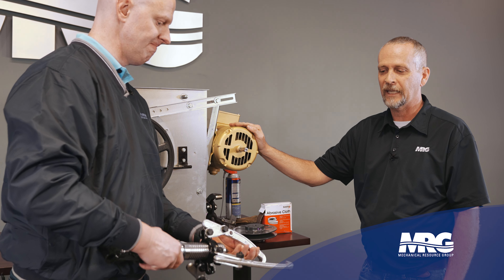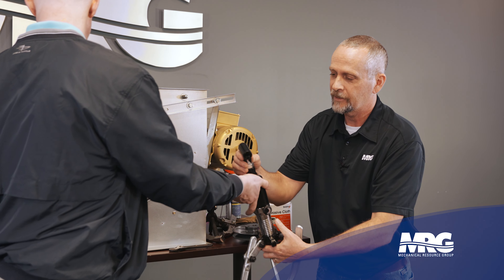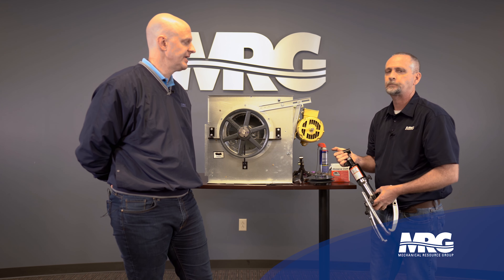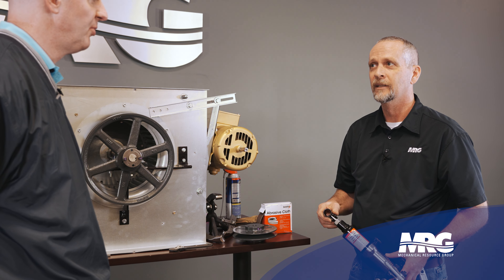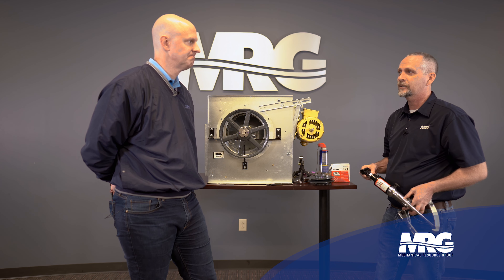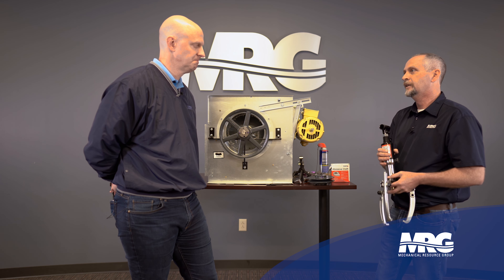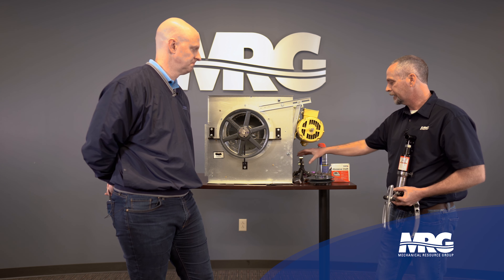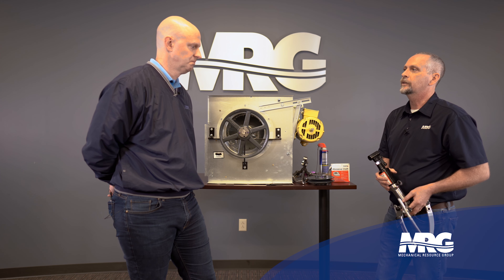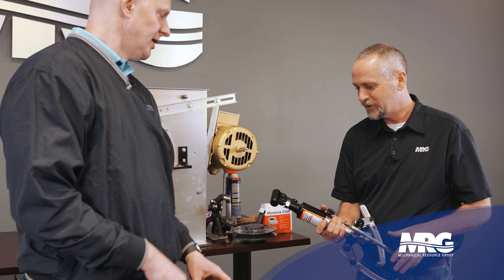Worst case — if it's 20 years old and you can't get it to come off — option number three behind John there is a hydraulic three-jaw puller. We might just break this thing if we have to. It works exactly the same way: you set it up the same way, same little center point, except you've got this jack handle. I think this one will do about five tons of pressure, so it's either coming off or we're going to break it. We've broken a few of these too — on bigger gear you think there's no way to break them, but you can. This would be last resort or for working on much bigger stuff like cooling towers. There's a limit to what you can do with little manual pullers before they break on you — then you break out the big one, and if that doesn't work, it's probably time for the saw.